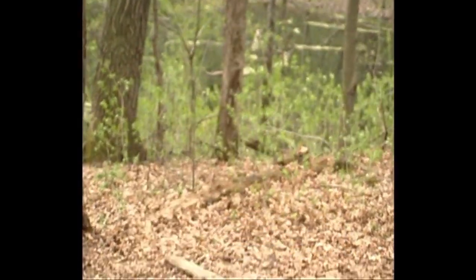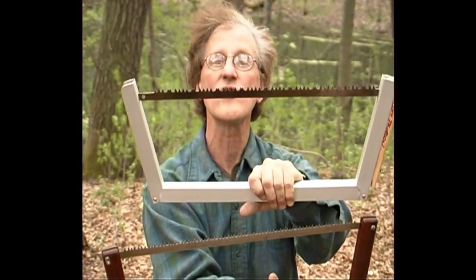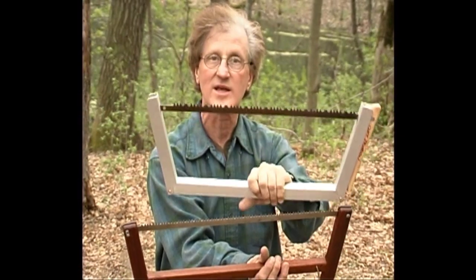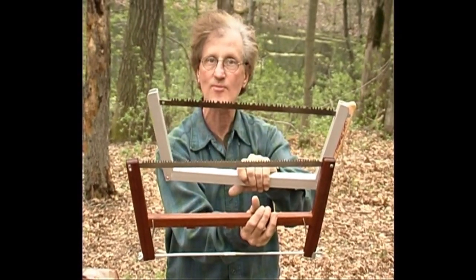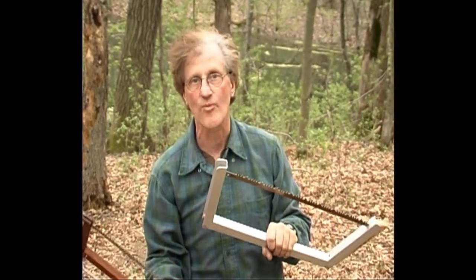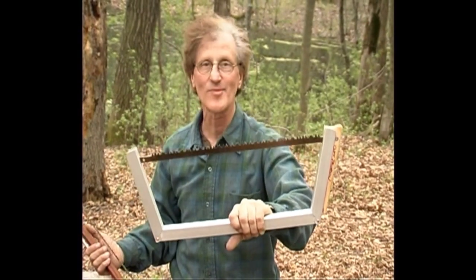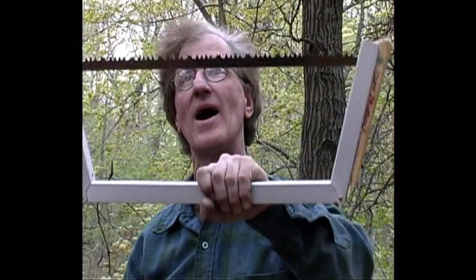If these 2 blades are the same length, and this saw has 1 raker for every 4 cutters, that means that 1/5 of the blade is useless as far as cutting. This style blade will cut 20% faster than this style blade. But you know what? It's a no-brainer. Manufacturers put this style blade on a lot of saws simply because they think it looks cool. People think it looks cool, so they buy the blades.